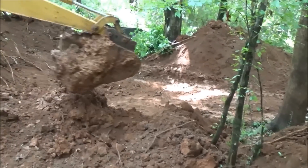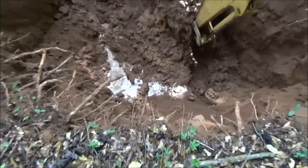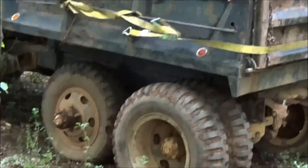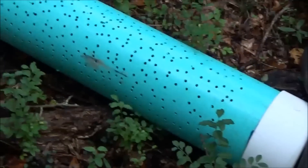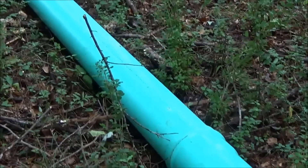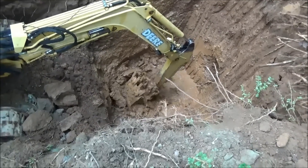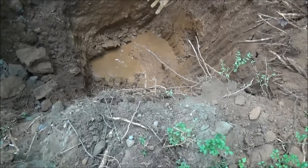We've moved most of the dry dirt out of the way and now we're going to do a steady dig into the mud, into the water — preparing our well. We'll line this hole with a number eight filter fabric, then put our stone in there, and after that set in our casing. The casing has a gazillion quarter-inch holes drilled in it with a glued-on bottom cap. We're not cutting the length yet — we'll wait until we set everything, then cut and put our eight-inch tee with pitless adapter setup.